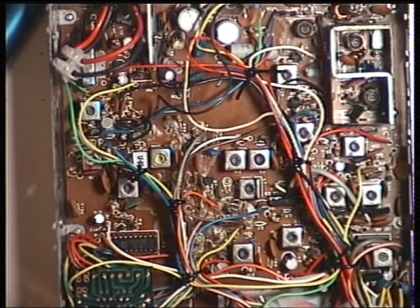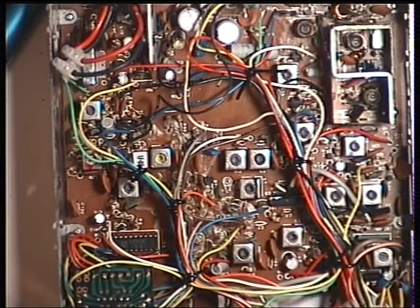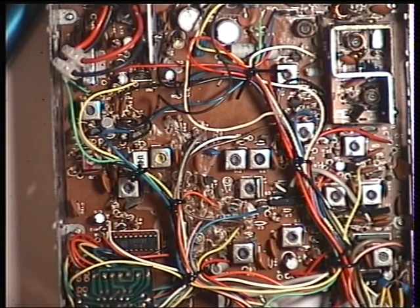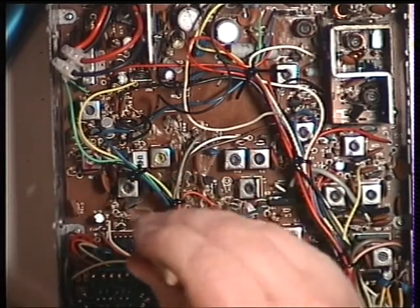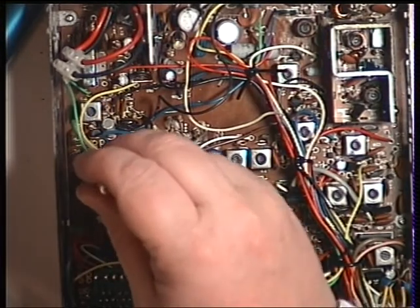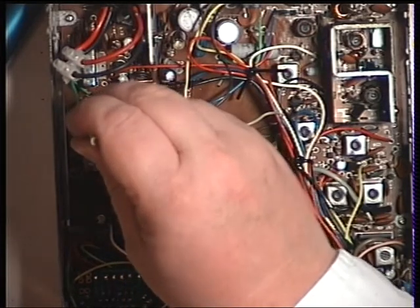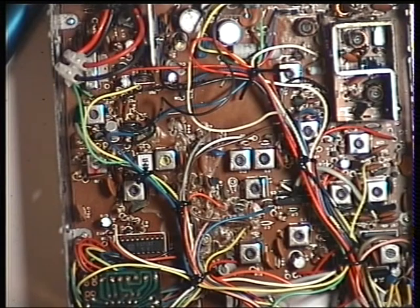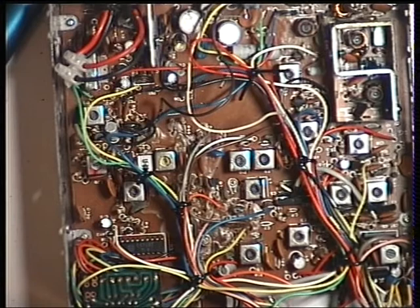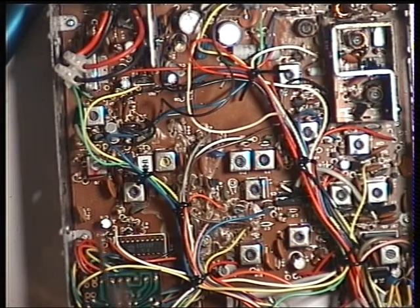I'm just wondering if that's a frequency on receive. I'm just going to check that with my marker oscillator in a moment. We'll just look at these IF ones. Okay. I'm just going to set up a marker oscillator on 455 kilohertz. So just one moment, I'll pause the video.